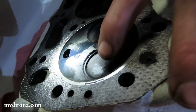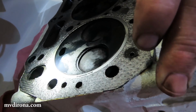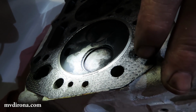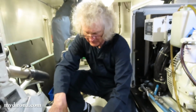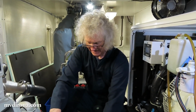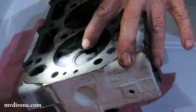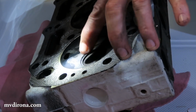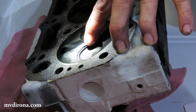and that is way recessed into the head. That valve seat's completely destroyed, and so there's no way to save the cylinder head. I was more or less operating on spec, saying I think the head would be difficult to save, but this head's not savable. The reason for it is because they don't have installable seats. On some cylinder heads you can replace the seats, but these don't have the clearance needed to have replaceable seats.